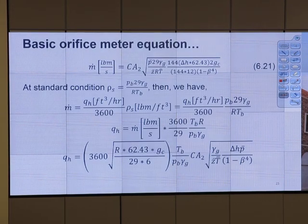But we don't want to pay more for the orifice meter or for the Coriolis flow meter. We can buy a more expensive meter, okay? More expensive means instead of a couple thousand dollars, you pay like $16,000. Coriolis flow meter is more expensive than the orifice plate. So if you use a Coriolis flow meter, you just get the number, look at it, it's done. There's no calculation to do, actually. It's just calibrated and verified and certified already.